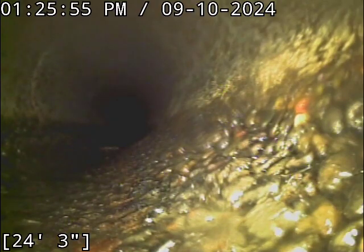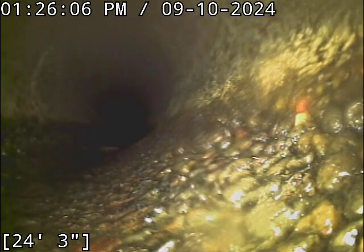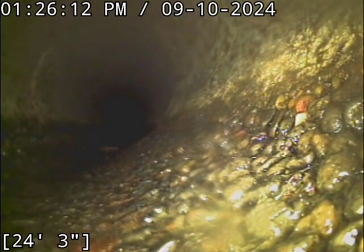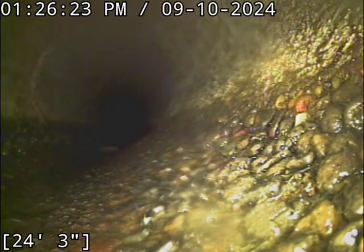All right, so where I was just out of there a moment ago, sorry, I thought the microphone was turned on. We're running underneath the walkway that leads up the front door, unfortunately, and I'm still having a really hard time getting my locator to settle in on a depth there, just about 15 feet out from the house. The depth is in the 9-foot ballpark, but when I hold the depth down, it just jumps up and down around 9 foot. The shallowest I got was about 8 foot 9 inches, up to about 9 foot 6 inches approximately.